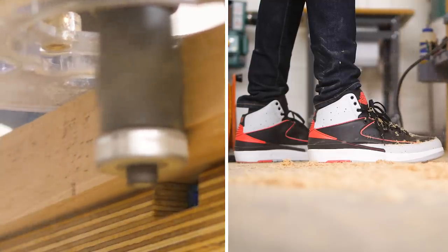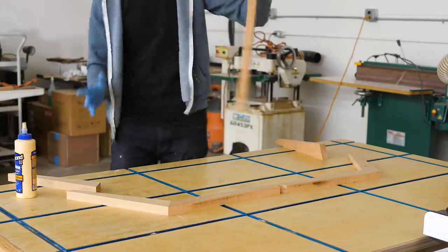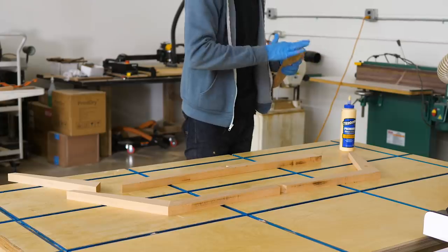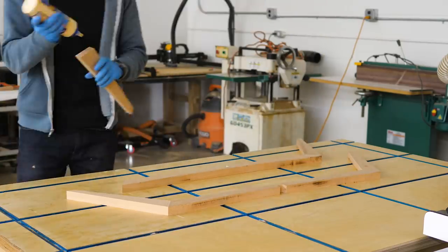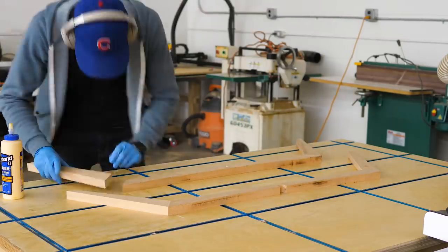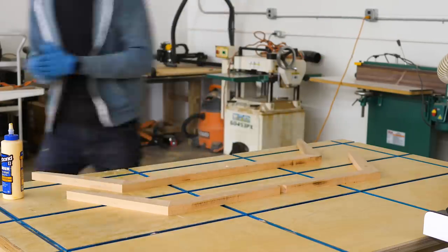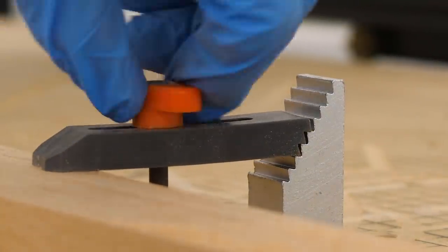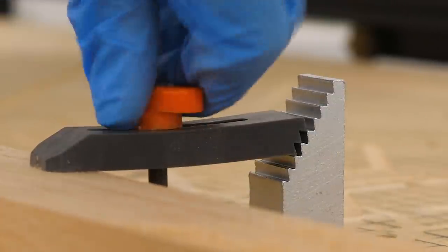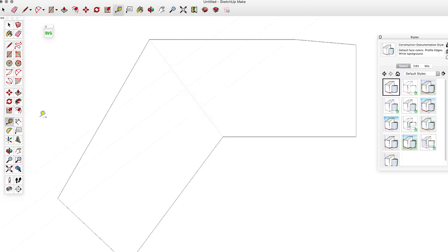Once I was happy with everything, I could glue up my miters. And this is where we start getting into the more experimental part of this build. You'll notice that I'm not using any jigs for clamping pressure, not reinforcing the joints with any dominoes or dowels or splines — I'm literally just putting glue on the miter faces and sticking them together with hand pressure. I just want the joint to look good, not worrying about strength at all. After the glue had dried for a day or so, I could get to work on the epoxy locking joint reinforcement. The basic idea: make a joint, don't worry about the strength, then cut a shape into it and fill it with epoxy for looks and to reinforce it.